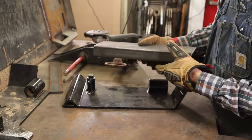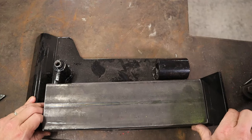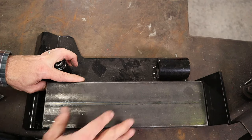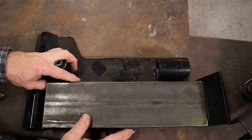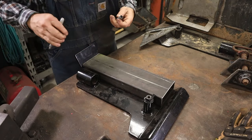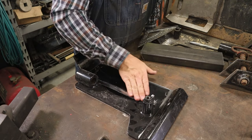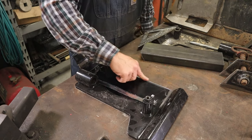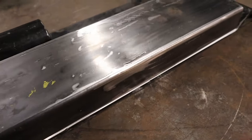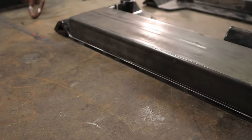1.5 by 4 inch that I just cut. Fits in there really good. Let's see that this is up against this stop right here. Not quite touching there. I'll be able to weld right along there. I'm also gonna have to grind a little paint off of here anywhere where I want to weld it. There we are. So I'm gonna let you take a good close look at these, where they're positioned and how they're on there, and then we'll start thinking about these weldments.